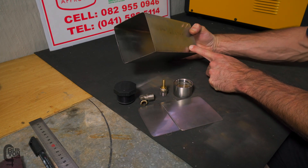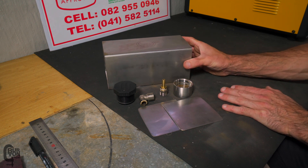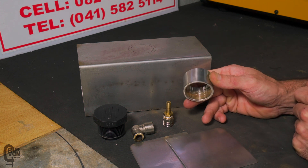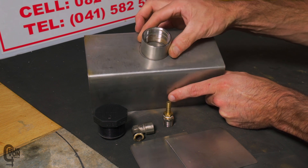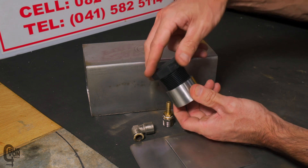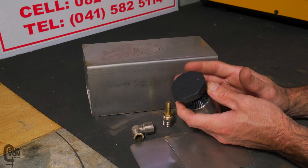For the main body of our fuel tank we're going to use this piece of stainless steel box section — it's about 100 by 100 by 220 millimeters long. We're also going to use this threaded section cut off the top of an old stainless steel water pump. We'll weld that on after making a hole first. For the fuel cap, I've got this one and a quarter inch BSP plastic pipe end cap fitting that'll screw in on top. We may need to drill a small hole as a vacuum relief as the fuel level drops.